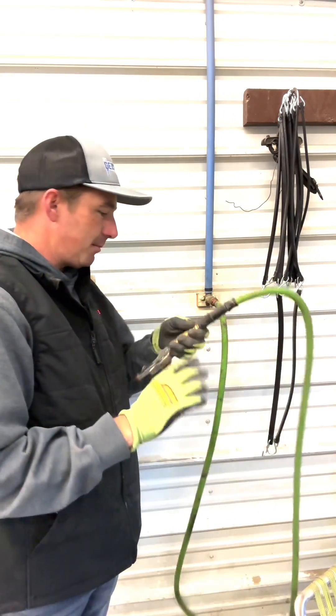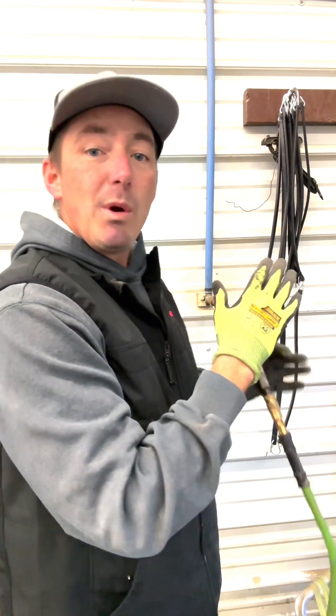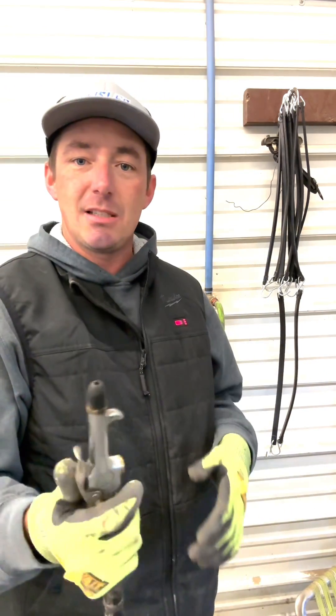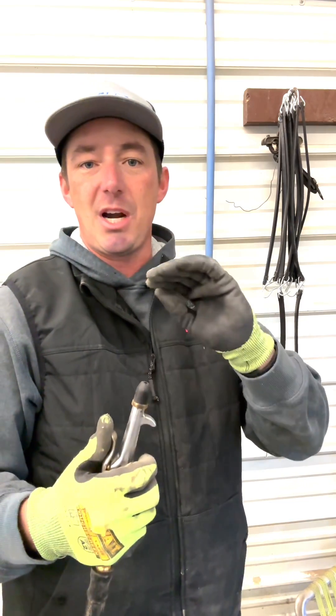There's a little bit of air running out there, so it should be off because I shut that off. The solenoid valve should close because that is shutting the air compressor off, and then we want to keep all the air in the tank — that is how we have this rigged up. Let's see if it works. I should be able to drain all of these lines and then it should just shut off without draining the tank.